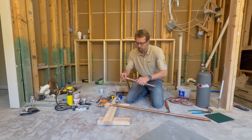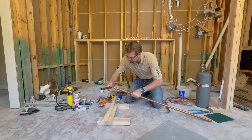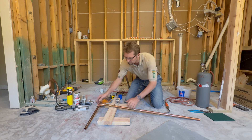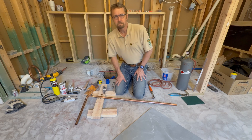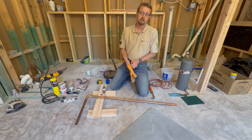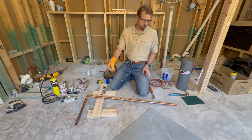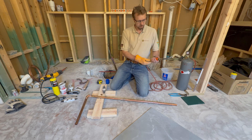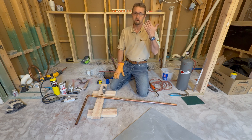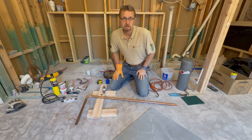I'm going to put the small pipe on one side of the fitting and on the other side, and place it just hanging over the edge — they aren't going to fall out or anything. Like any time you're doing welding, brazing, or soldering, you want to use some eye protection and hand protection. I don't know where my other glove went, but this is the hand I'll use with the brazing rod and this is the hand I'll use with the torch, so that's fine. I have a face shield but it's a bit scratched up, so I'm just going to use my safety glasses instead.